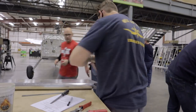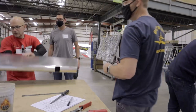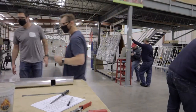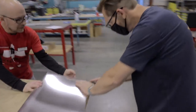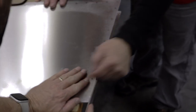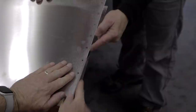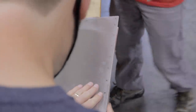Now, that's perfect for me as a lefty, but for you, this would be the easiest to do. Stand on this side. If you see space here, you're not at the right angle. You want to have that almost always. Try that with this finger, you're applying pressure where you want the material removed, but you do want to have that attacking here. That way you know you're perfectly straight. Perfect.